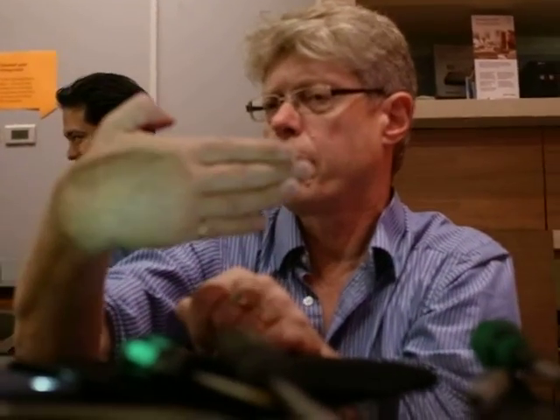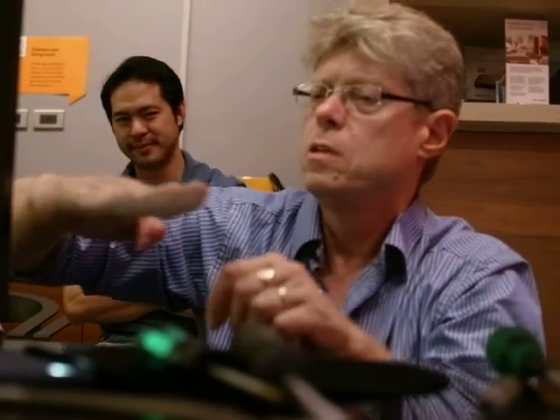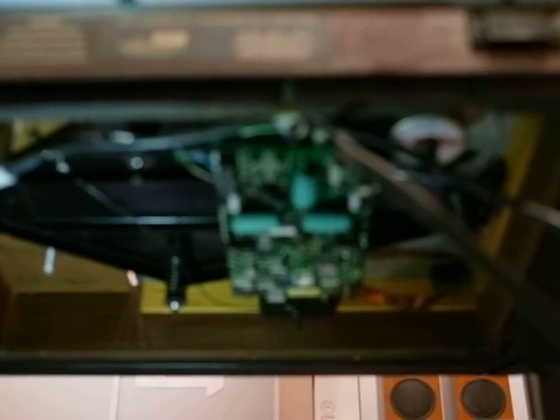The other thing with an arm cable with this style of P-clip: the cable has a left and a right. The cable goes through the P-clip like that, but it leaves the tonearm like that. So the trick is to put a twist in the cable — see the twist there? It comes out flat, twists, and then exits that way. I do that just by twisting and holding it on a surface. It will hold the shape.